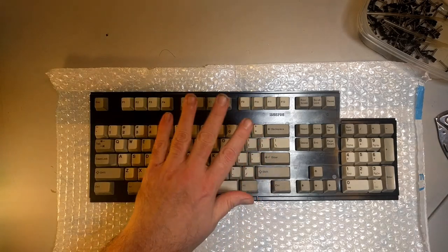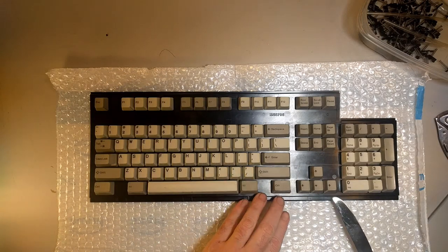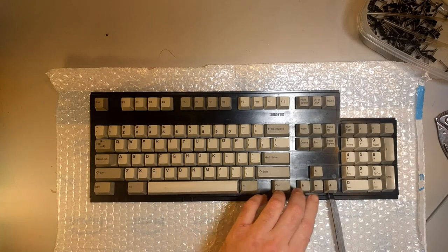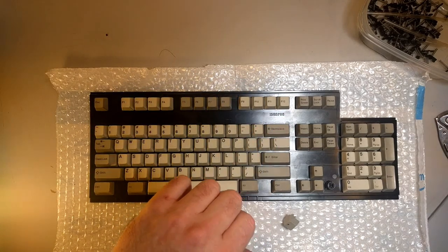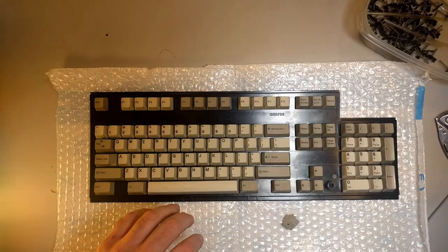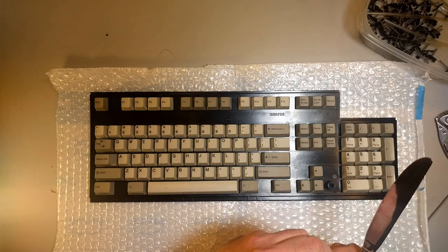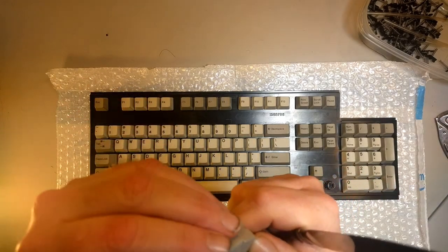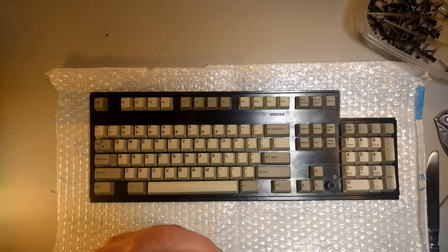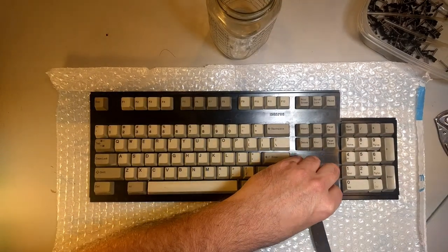Let's see, survey the damage here. I put a little bit of packing material underneath there. I know my fingernails are dirty. I know it. So it's real easy to take the keycaps off. I typically just use a butter knife. Actually, before you embark on this, it's probably a good idea to take a picture of this, because it's awful easy to forget where these keys go. These keycaps, by the way, are of a particular style. They're a double, a key stem and then a key cap. Not all Model M's are like that. These are. All right. This will be a montage, I'm sure.